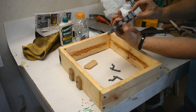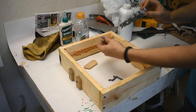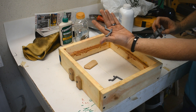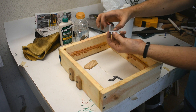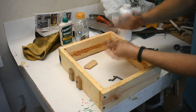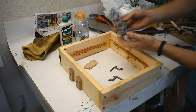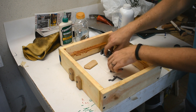This has varying thickness. You're told that having a consistent thickness on a sand cast part or any cast part is nice, because it allows the metal to solidify at a set rate. Thicker parts will hold the heat longer and won't solidify as evenly, and you end up with problems — shrinkage and whatever. We will find out. This is all a test, like everything I do.